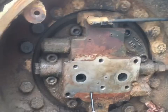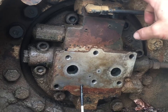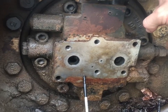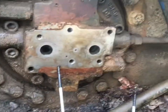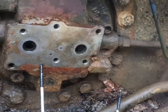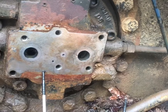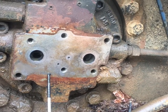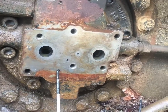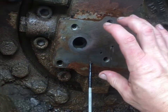There are typically four lines on any track drive motor. You have a high-low selector line — put pressure to put it in high, relieve the pressure and it puts the motor in low, changing the displacement. You've got a case drain, because all motors leak into their case a little bit — it's inherent, they're not sealed perfectly. Rather than force oil back out through the return, they add a case drain to keep pressure low and prevent blowing seals.